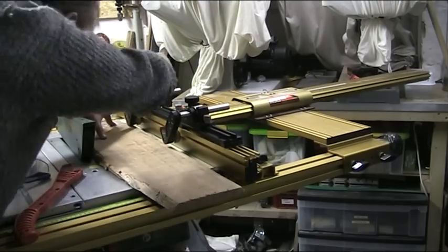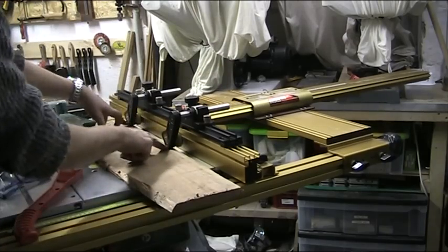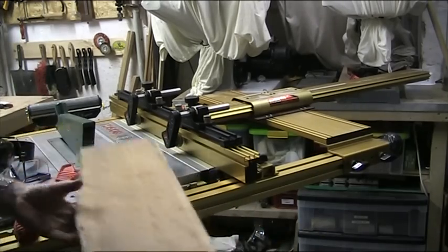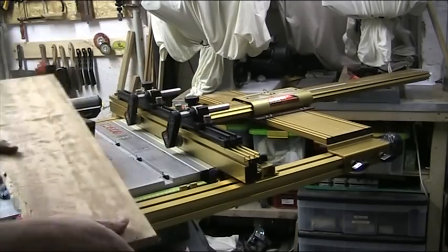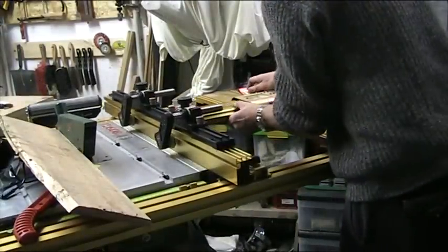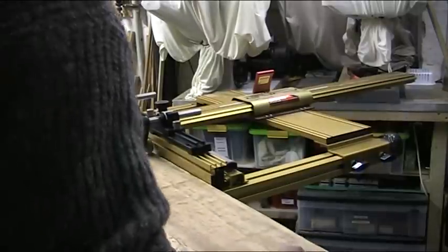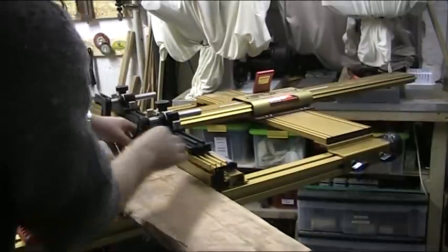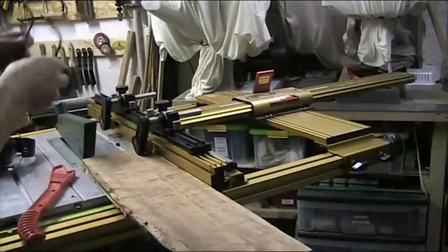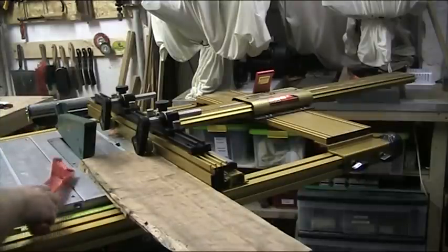So we'll set up the stock guides, using only this face here and not on the rubber. Pull it backwards. I want to cut 150mm from here, so I'll just quickly step over and set up the fence repositioner. Lock that in place and set that — you can feel the pressure already as you just put that in to set up the cut. I'll just put on some ear muffs, turn on the vacuum cleaner and away we go.